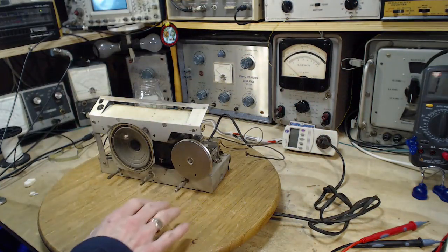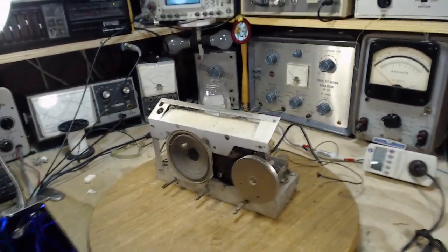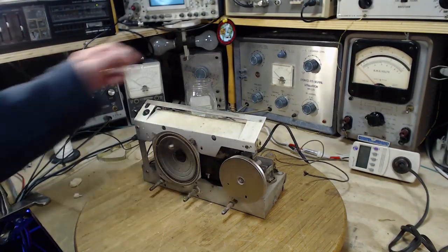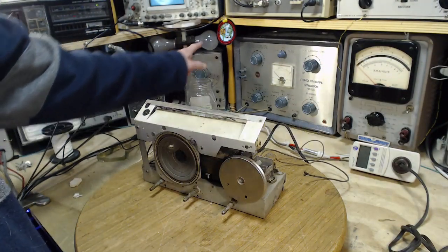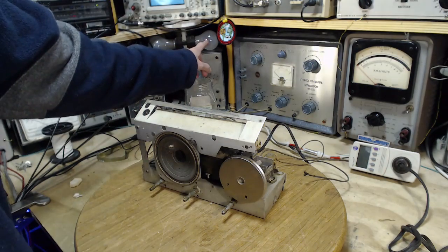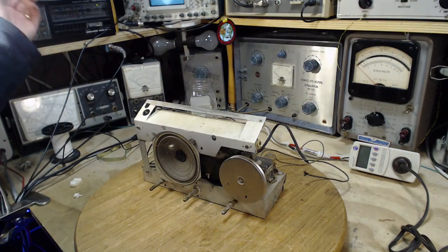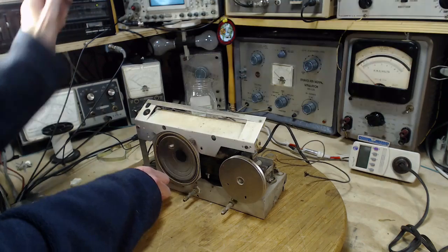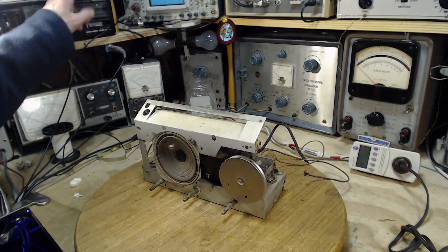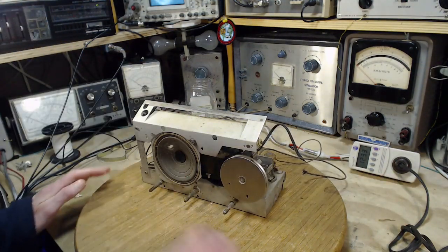Now, I wouldn't try this with any radio if I didn't have some way of blocking a short circuit. So I use a dim bulb system in my shop to do that. These are the bulbs. Just this one is screwed in right now, so the power going to the radio is passing through this light bulb. The light bulb is in series with the radio, depending upon how I throw my switches. If the switch is off on the radio, we should expect nothing to happen. All 123 volts sitting here.